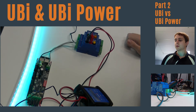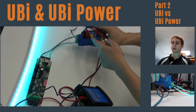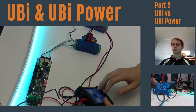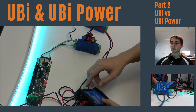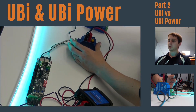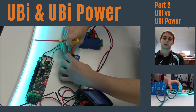There are two different models of our Yubi: the Yubi with no power supply, and the Yubi Power with our DALI PSU integrated into the unit. In this configuration, the Yubi Power is supplying the power for the DALI line and our Addict is not. I can easily swap this Yubi Power for a normal Yubi, so now there will be no DALI power supply powering the Symo.